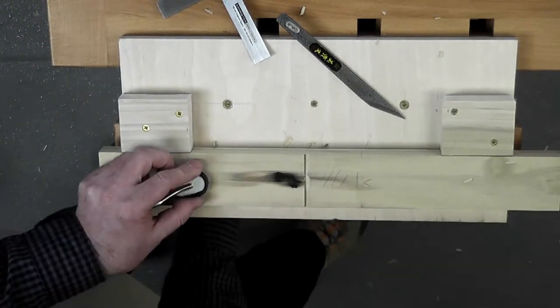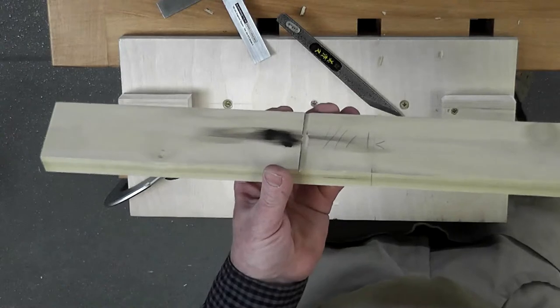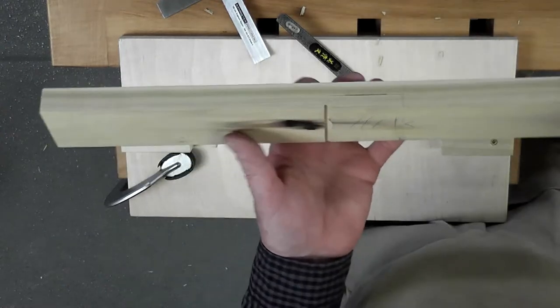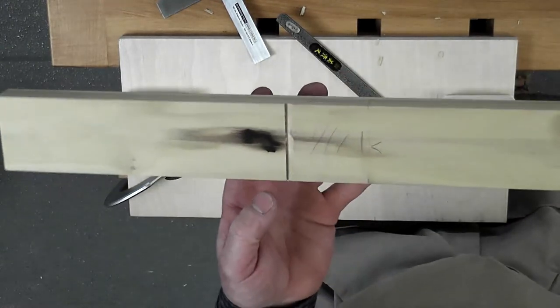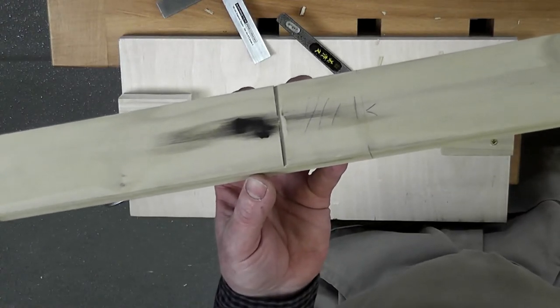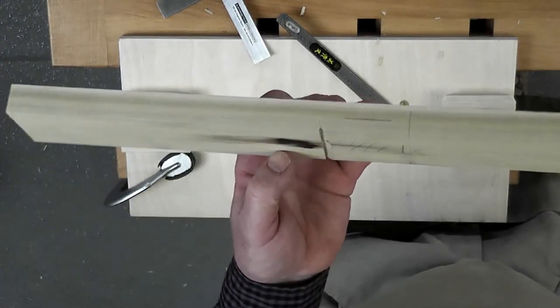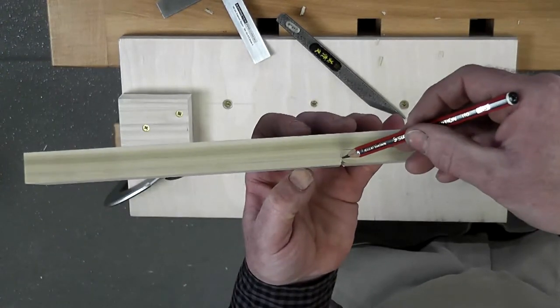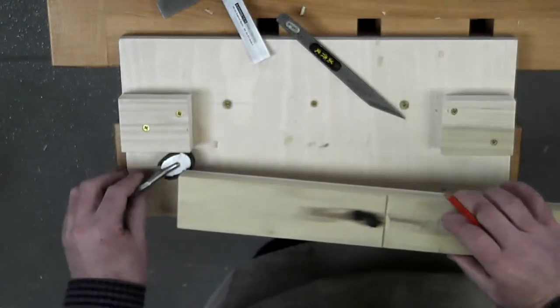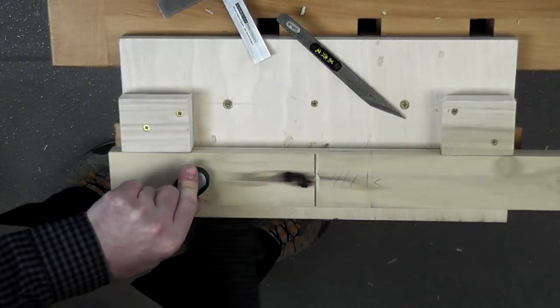Now, I will say, like I said yesterday, I'm hoping we're not offending anyone by trying to do this. It's taking it maybe to a little bit of extreme. This is fine furniture making. If you're doing cabinet making, you might, you know, okay, you do that. The joinery guys, well, it might be a bit over the top, but it's giving you a lovely crisp shoulder. So we've got that nice V. It's come down a little bit, all the way across. Fantastic. First bit done.